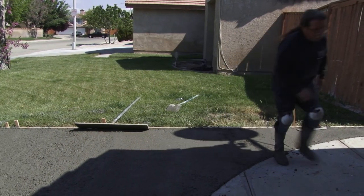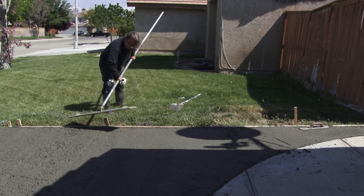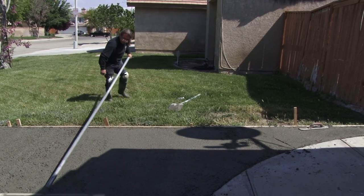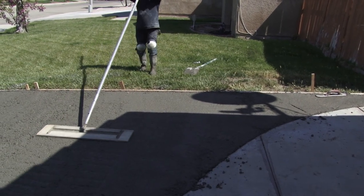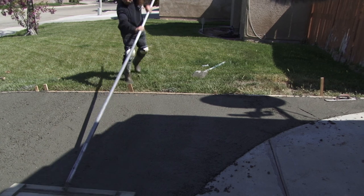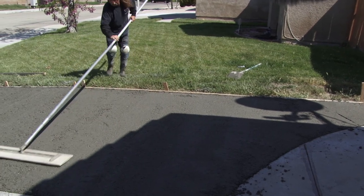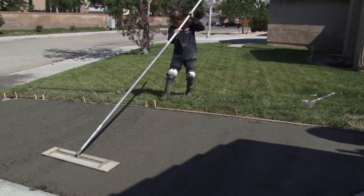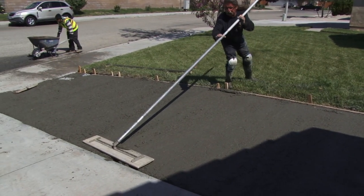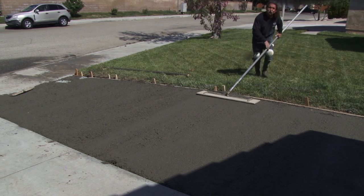I'm going to get another pole and lower the angle. With a longer pole, I get a little bit more waggle out of it. Notice we're both floating across the way we rodded it. It's a little bit high right there, so I leave the bull float flat — see that? — and it kind of cuts the mud, and we just drag it back out of the way.